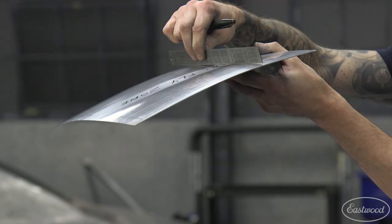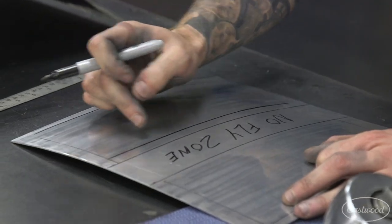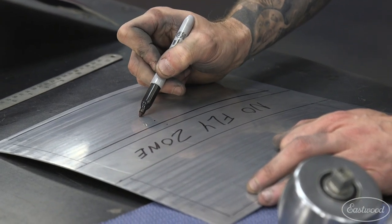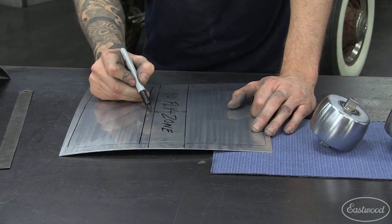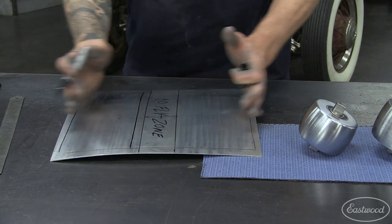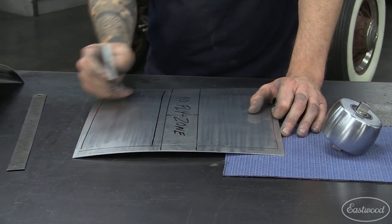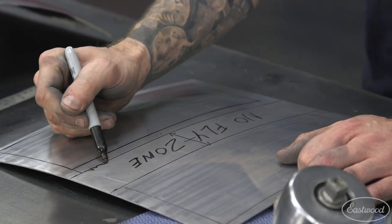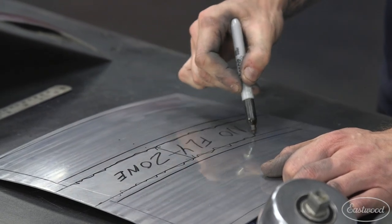The reverse is really starting to come in. Now let's concentrate on making this transition a little bit smoother. We're going to move the no-fly zone in a little further so that this area will be shorter than this area, which will be shorter than this area — we'll keep moving it in. The center here is the shortest — we never wheeled from here to here. We have about six passes now at the edges, and we'll have more as we taper out. That no-fly zone is going to keep getting wider and wider — that'll keep the panel having a smoother transition instead of just sharply coming up. Now we're going to keep these edges the same, but how far into the center we go is going to stop on this new mark instead of the previous one — we'll do that on both sides.